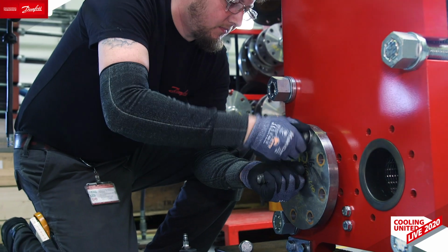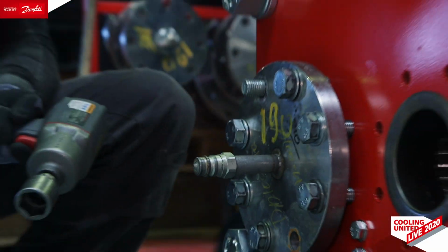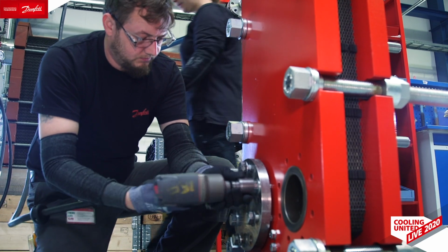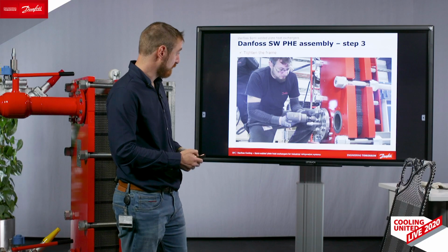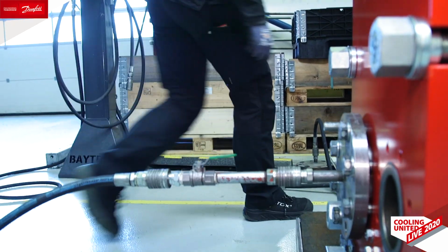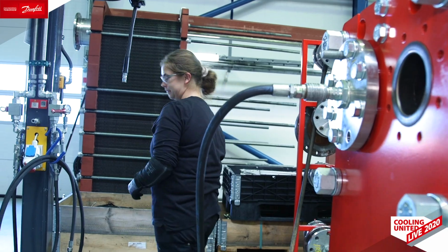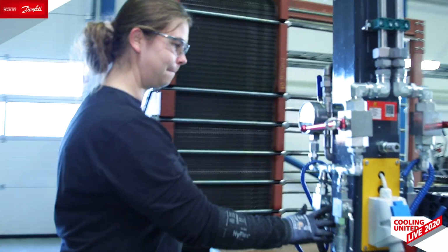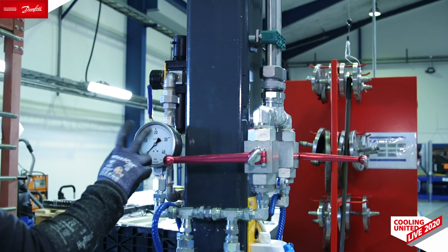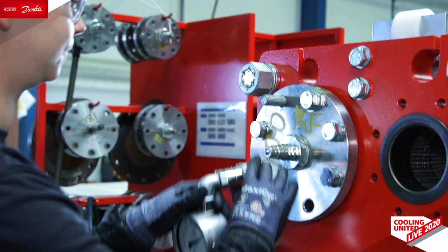Now the next step is hydraulic test. They are mounting at the moment the counter flanges for the test, which are with a special connection for our testing machine, which is in the next video. So they enter with water in the bottom, and at the beginning suck air from the top, so they vent the heat exchanger. Now the differential hydraulic test starts, which means that each of the sides separately is exposed to high pressure for a period of half an hour.